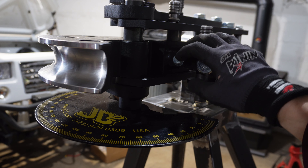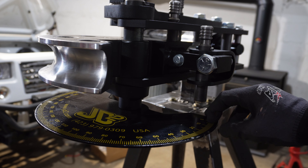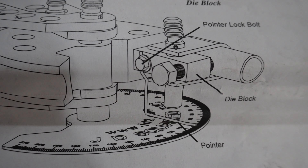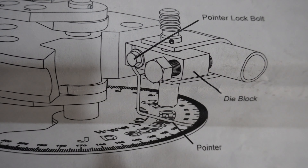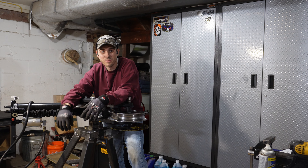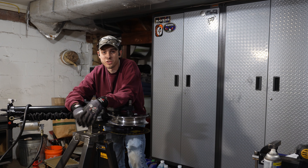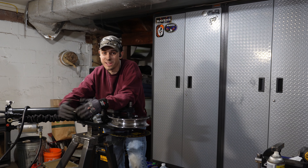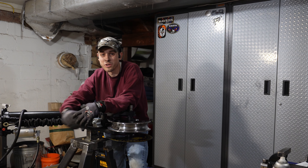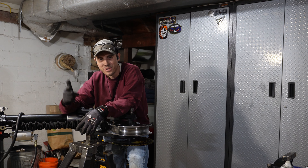Take a TIG rod, bend it to come down and point right at the dial indicator — as you bend tube it'll show you the exact degree of bend. I won't bend that rod until I'm actually ready to use the bender. The stand is built and the bender is pretty much assembled. Now I just need to figure out how to use this thing. If you want to join me on that journey, hit the like and subscribe — DOM tubing is extremely expensive and that's what we'll be building the roll cage out of for the Reaper. Thanks for watching and I'll see you on the next one.